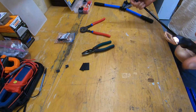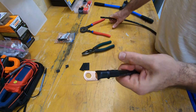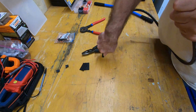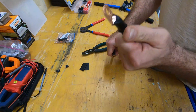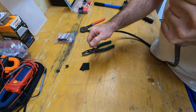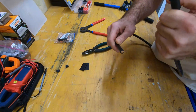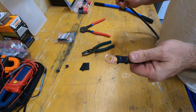On to the other side — we will repeat this on the other side. But the most important thing to remember when working with this rigid of a wire: it's not easy to bend it around. So if I just put a lug on the end in the same direction and I need to twist it to fit a different area, I might need it absolutely on the other side. So you're going to want to take this over to whatever you're fastening it to, simulate that you're going to connect it, run your opposite side to where it needs to go, mark how you're going to put on that other lug. Because once it's crimped you're not going to be bending this wire around easily, and you want a good, correct connection.